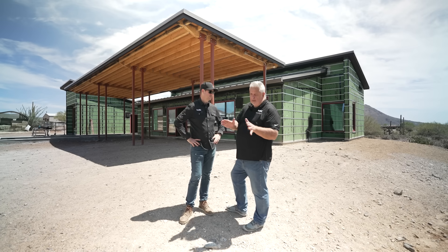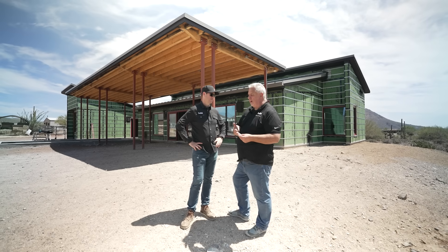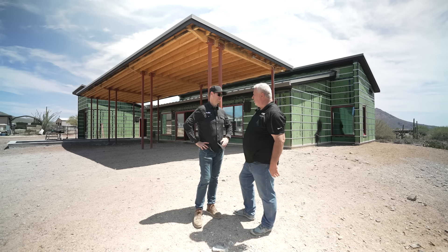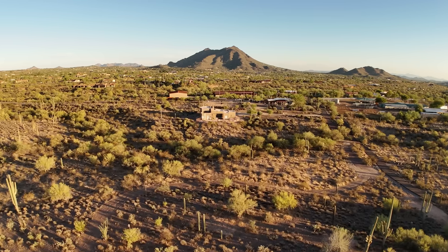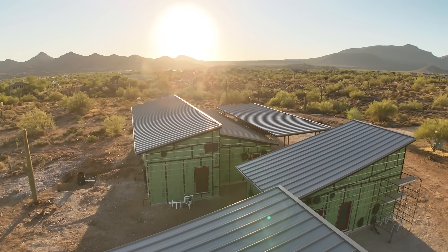Beyond all the durability and building science metrics of a metal roof, they always look beautiful. They perform exceptionally well, come in many different colors, and clients love not having to deal with asphalt roofs and algae growing on them. You just don't get that with a metal roof. In this climate where it's so hot, there's an SRI — a Solar Reflective Index — where even a dark color metal roof has SRIs in the thirties and forties, and a lighter color might approach 80, 90 or above. Compare that to a typical asphalt shingle, which is much, much lower. These metal roofs are really shedding the sun's heat to the outside.